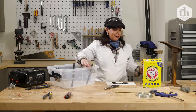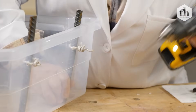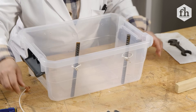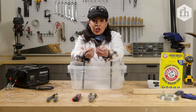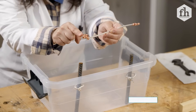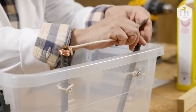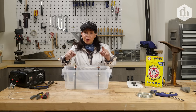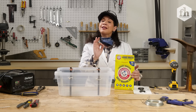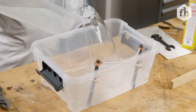Now I'm gonna show you a really cool trick. Now that we've got our rebar connected, we are going to make a daisy chain connection with a copper wire. It's plastic coated so that we're safe, and I've just exposed the ends — making a connection from one piece of rebar to the other. Now we're gonna make an electrolyte solution using super washing soda, which is basically sodium carbonate, which is basically salt. So we're going to put in first the water.